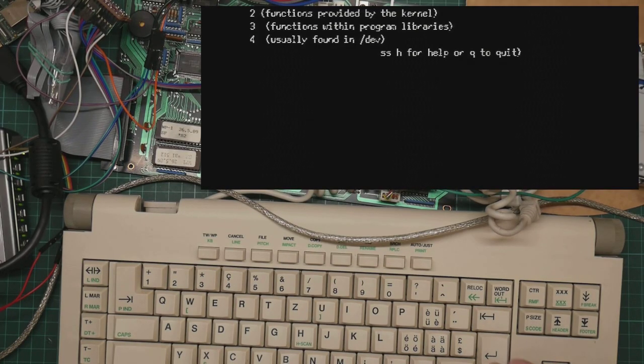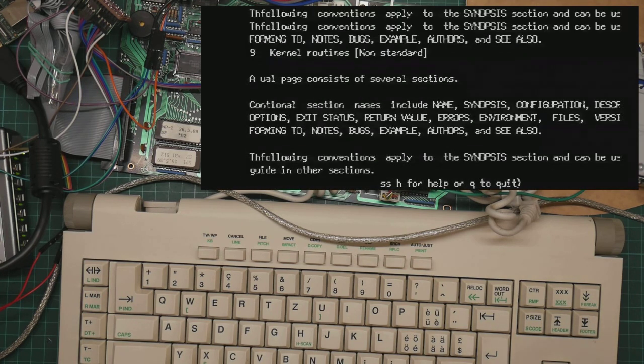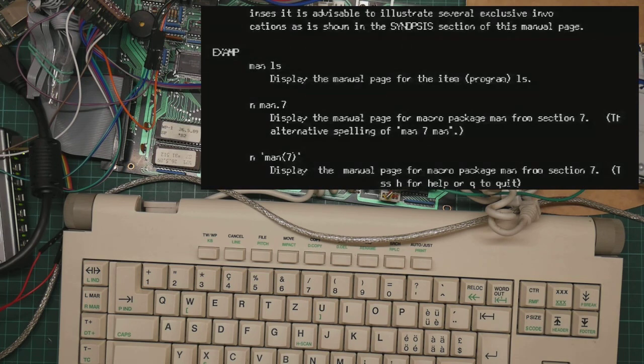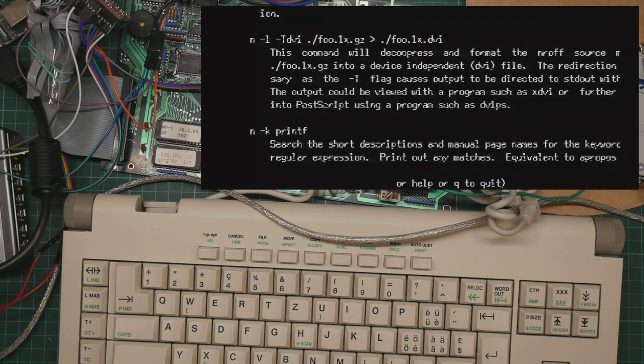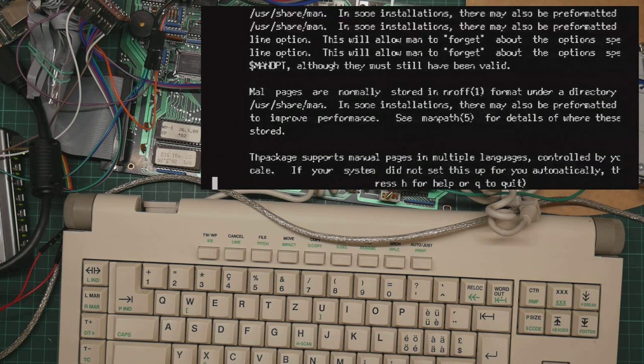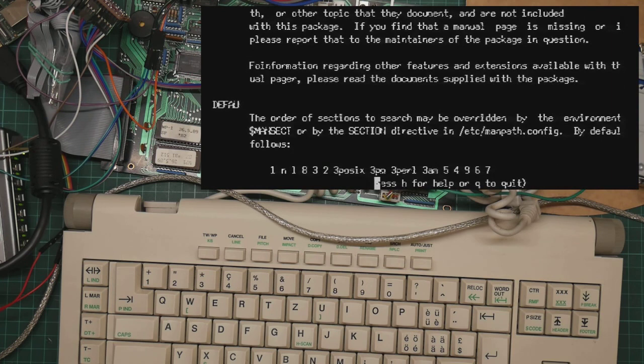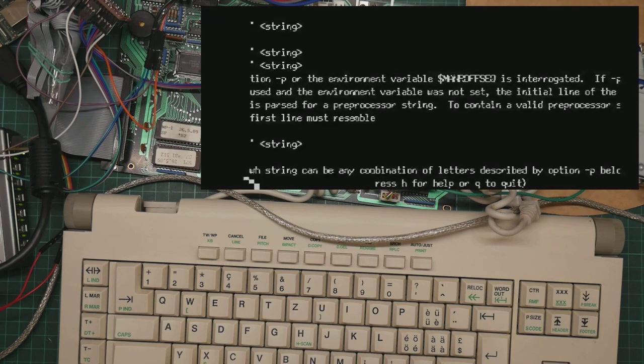So yeah, we're still in the man page. Control L to redraw. That's not great. Yeah, what this is doing is it's updating a few rows. Then a character comes in, so it stops redrawing. The character is processed through the state machine. This causes the screen to scroll, which dirties everything. Therefore, when it does the redraw, it starts again at the top of the screen. So that's not brilliant.